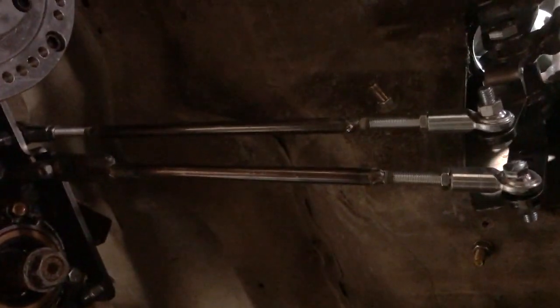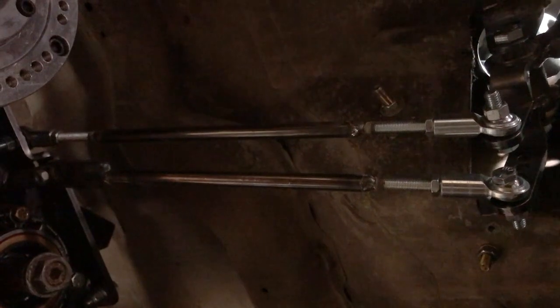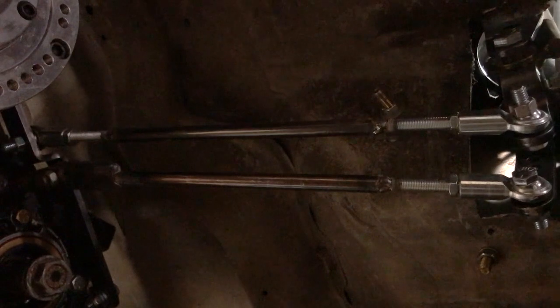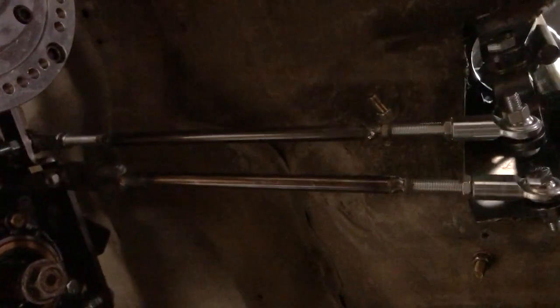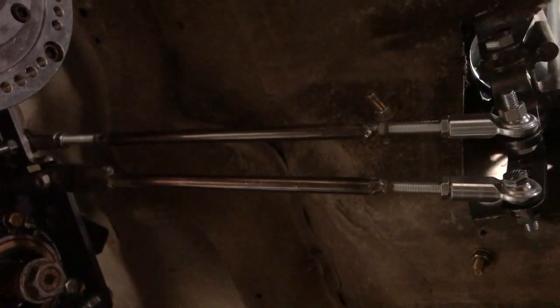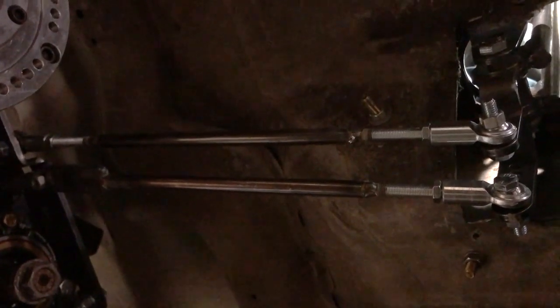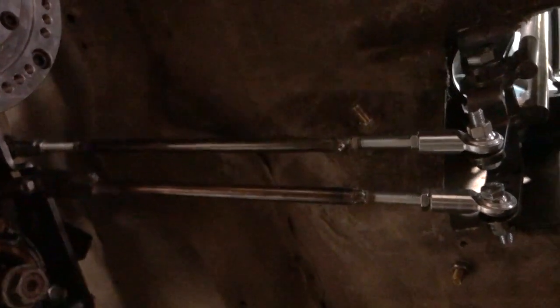Rear low. Front low. Front back to neutral. Rear high. Front high. Front neutral. Rear neutral. The front will not move unless the rear has been engaged first. That is so that your front axle and your rear axle don't spin out of sync and don't bind against each other.